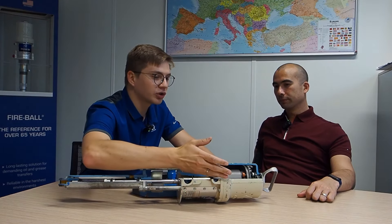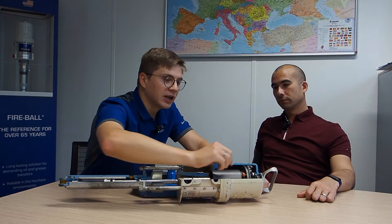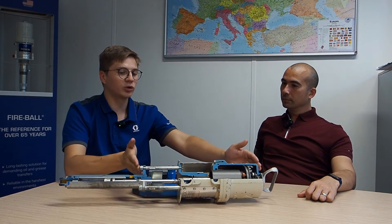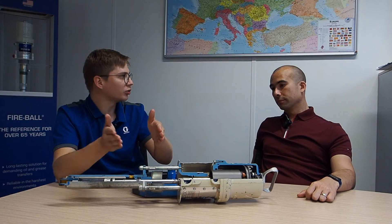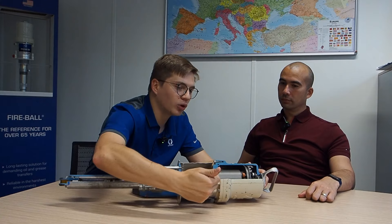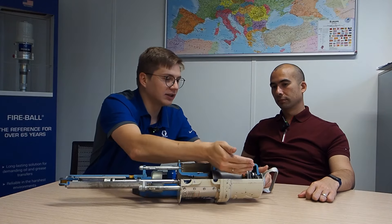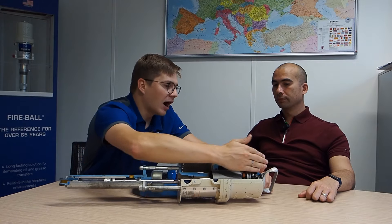The air comes inside, the air creates pressure on the downside of the air motor, the air motor piston goes up and while moving up, it also moves the rod. If it's an oil pump, it would create a suction movement, sucking everything beneath it. That's why most likely you'll see what we call the universal pump - it's the air motor with a short part where you connect your hose or tube to put it on a drum, tote, IBC, or bulk tank. When the air motor moves up, it sucks the oil downwards from the pump, then as soon as it reaches the valve, the air valve switches sides and the air starts flowing backwards - the air just circulates inside the air motor up and down.